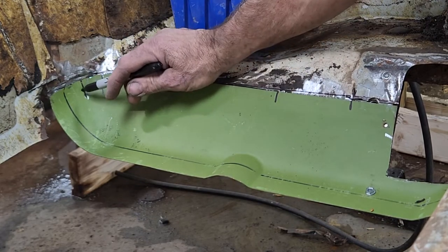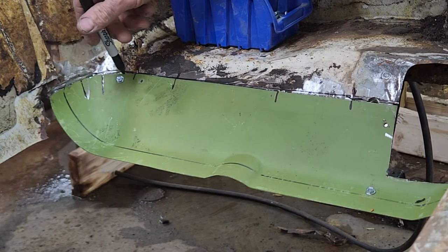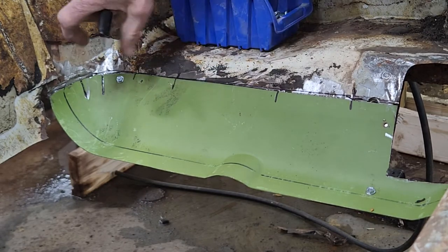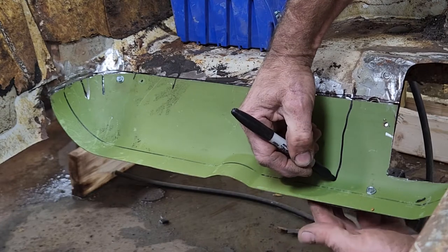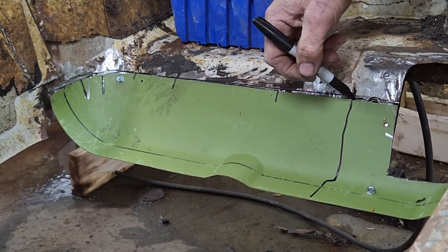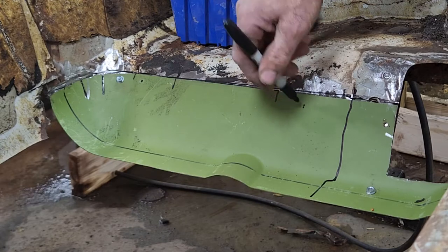Like I said, made these marks coming up. And right here, because the curve was kind of stiff and it wasn't quite right, I just notched it out with the cutoff wheel so I can bend that a little bit, and I'll weld it solid. And behind here, going like this to here, that's where the main brace is for the seat belt. And right here, I left an 1/8 inch gap. And here, the floor panel goes beyond it.